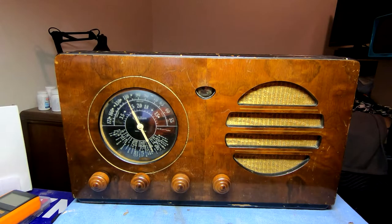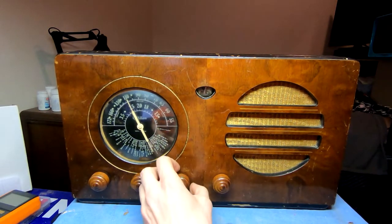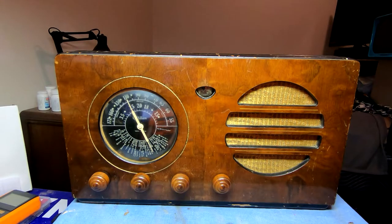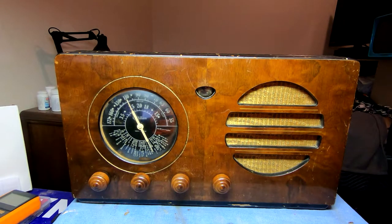We also have power, tone, and volume. On a normal radio you find the volume control and power combined into one knob, and the tone control usually winds up being just a set of fixed positions. However, other sets — I have a GE A70 actually — where the power switch is also the tone control and your volume is completely separate. The idea being you turn on your radio, listen to it, leave it at a set volume, then shut it off, and when you turn it back on you don't have to fiddle with the volume again. It can be a little confusing since a lot of manufacturers didn't put labels on — it was expected you'd read the instructions.